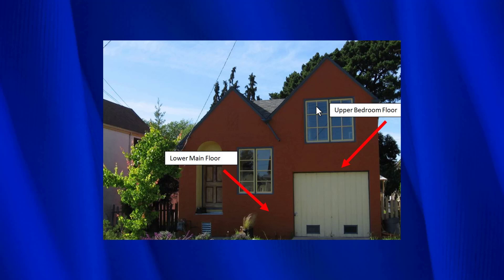This is a split-level house that we see all over the East Bay Area and also in the peninsula. This type of house almost always has balloon framing. When they built this building, the first thing they did is they built the garage with the room above it. After that, they built this floor, which is attached to the wall that extends up for the garage. They took the floor and nailed it to the side of the 2x4 studs that go up this way, and they never put a top plate in.